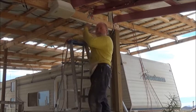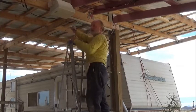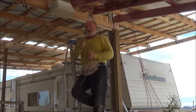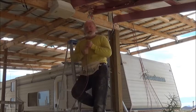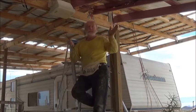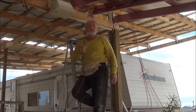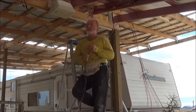I've just installed a row of them here and now it's time to wire them. For wiring, I'm using one wire for one solar panel and it runs all the way inside. I've got number eight wire here and I'll probably get emails or comments that this is overkill — that I can wire two or three together. Yeah, you can. I didn't want any loss. I felt like spending the money on overkill. I'd rather have too much than wish I had just a little bit more.